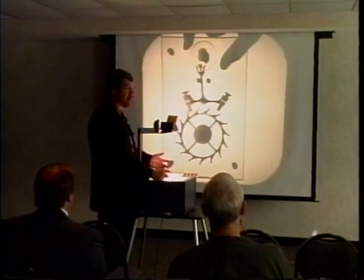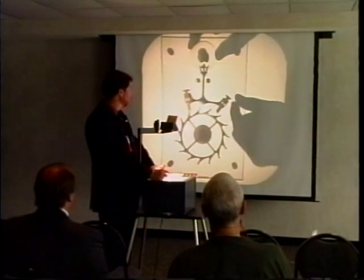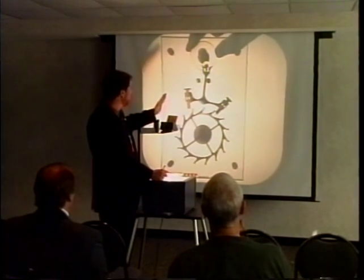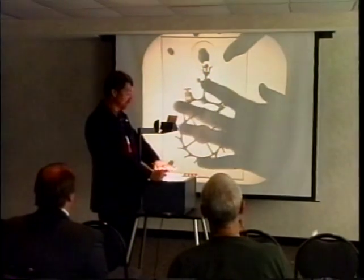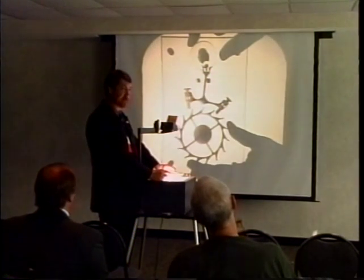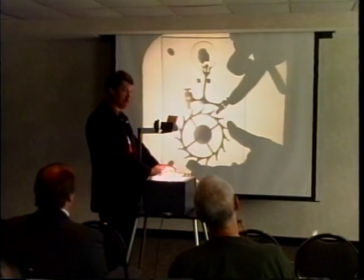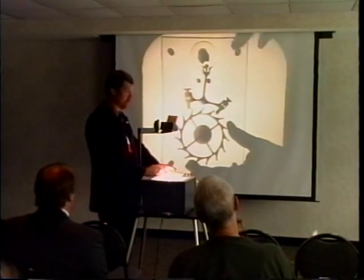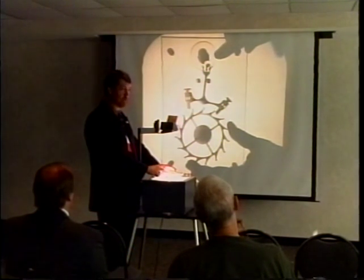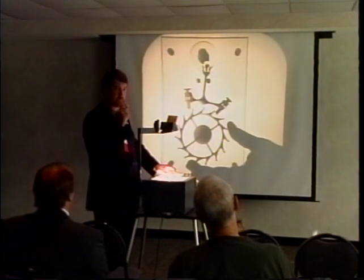Right, if you pull it out too far, it won't work. But if we just pull it out a little bit, what happens is it lifts the pallet fork so that the fork slot and the shank is closer to the banking pin. If we pull this stone out, it means it stays in contact a little bit longer so that it can get a little bit closer to the banking pin before they separate. So that means that the corner clearance of the jewel escaping the slot increases a little bit.